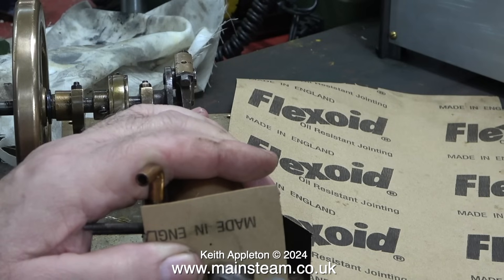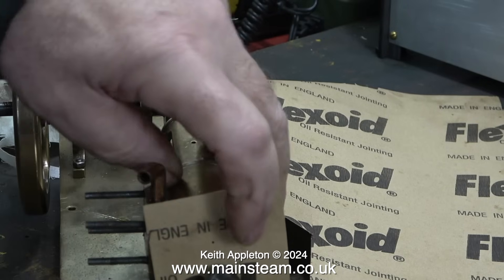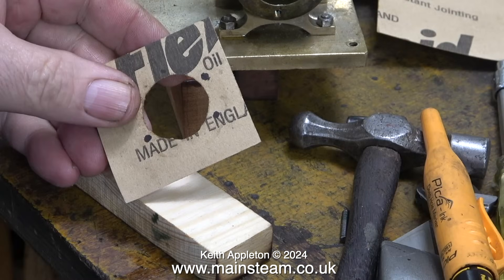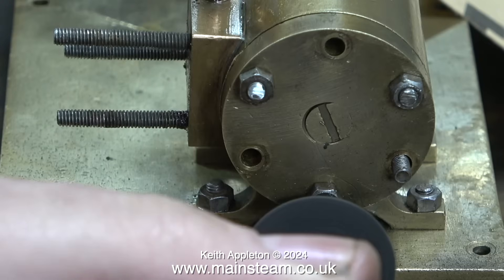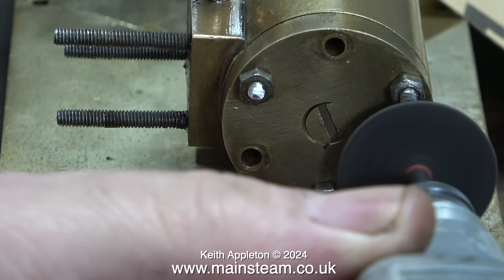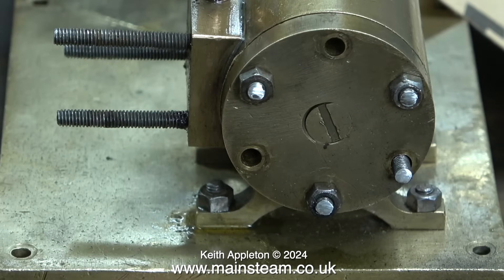Time for some gasket making. This is a whole new technique I saw on John Mills's Double Boost channel, where he cuts the gasket on the end of a cylinder with a ball-peen hammer. I don't want to do that on a brass engine, but gentle hammering leaves a perfect imprint of the cylinder end on the gasket paper. I've shortened this sequence but you'll get the idea. Now it's time to refit the end cylinder cover complete with the gasket. I'm also cleaning up the ends of the studs — they were rough as sawn — using a cutting wheel in my Proxxon motor tool.